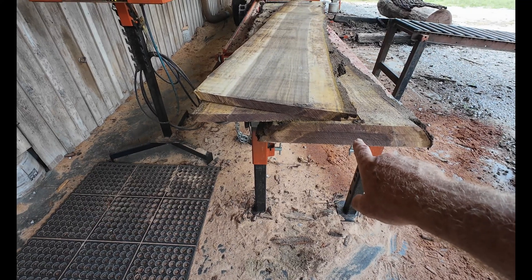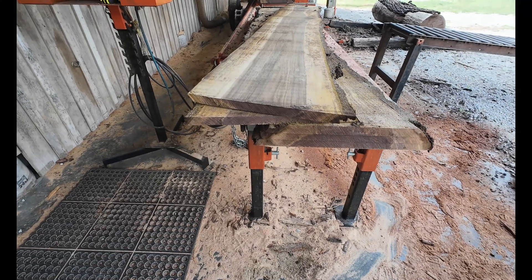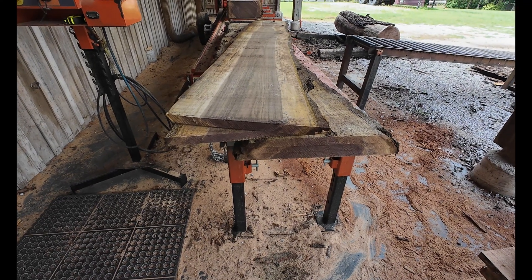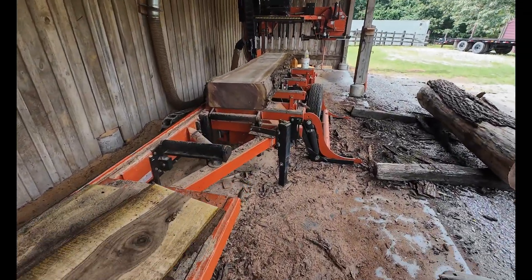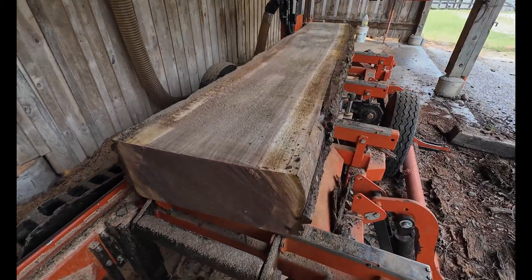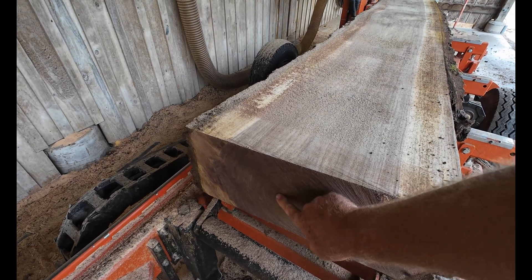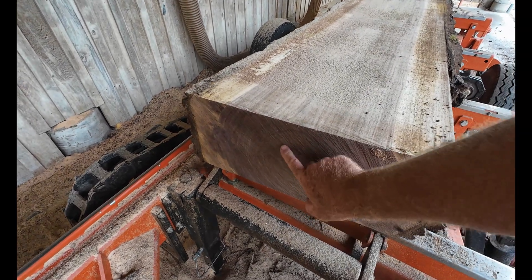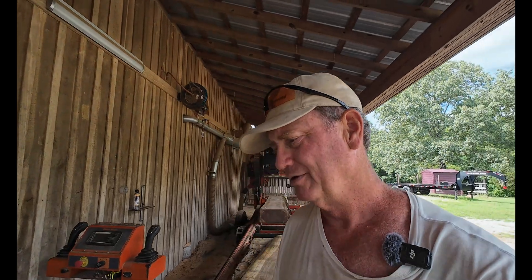The strategy is slightly different than when you're sawing up regular high-grade hardwood. You try to guess where the stress is going to be before you start sawing, because basically once you start sawing bark to bark, you're committed. The good news is these are very stress-free, so I got lucky. And then as you take these guys down, you should form a full heartwood cant or one that's very conducive to heartwood cant. Of course, you never saw through the pith. And that's another reason I'm going to start dropping down here — I may get a couple there, but this is kind of a waste of time.